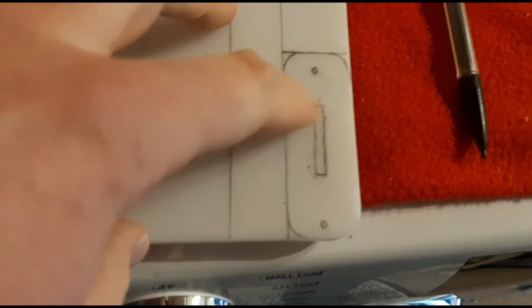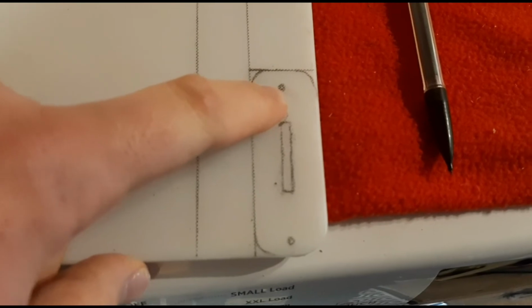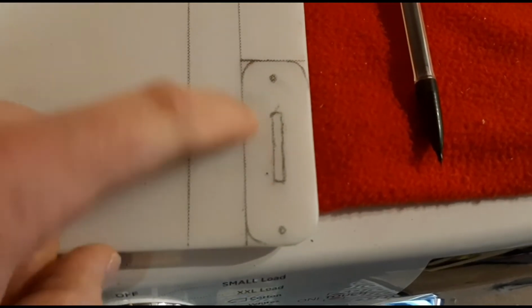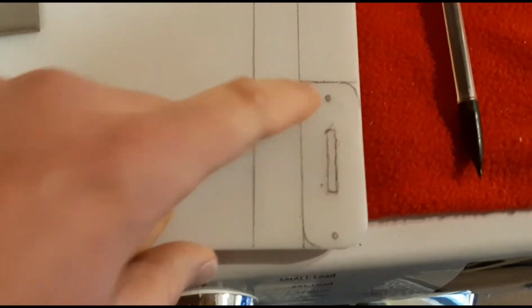But once these are cut out, just ring that in. These will screw into the deck with just some small screws, and there'll be some butyl tape or something underneath here, some Sikaflex, just to squeeze into that, make that kind of seal, if you like. So I'll make 6 of these, and then just cut the holes, and then they're ready for fitting.